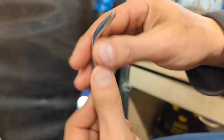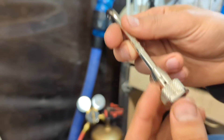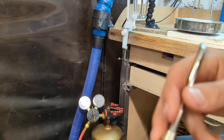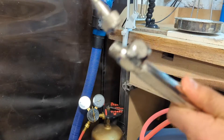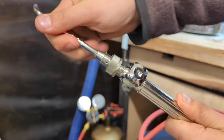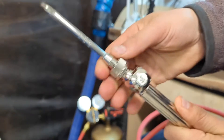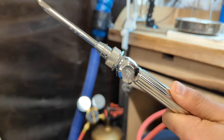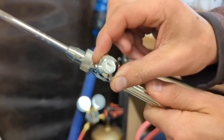There's also a size 00, which is even smaller. And then we have tips going up to size number 2. The smaller tip you use to make a smaller flame; the bigger tip you use to make a bigger flame for melting larger amounts of metal. So we're going to take this torch handle and put the tip right in it. We're going to have the tip facing away from that knob, and then tighten it down just like this — nice and snug. No need to use a wrench or anything; you just snug it with your fingers. And we're going to make sure that this knob is closed so that no gas comes out when we turn on the regulator.